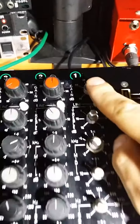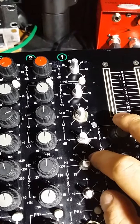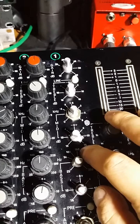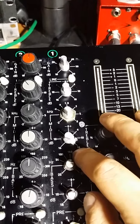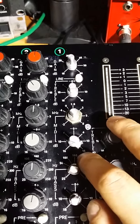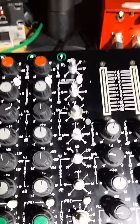On channel number one, I'm getting all this noise. I reattached one of the molex connectors — you can see it in the picture there — it was attached incorrectly. I was off by one pin and I probably sent voltage somewhere it shouldn't have been, or shorted something out. I think probably the op amps or something. So here's what's going on.